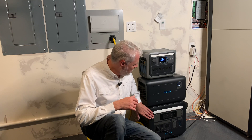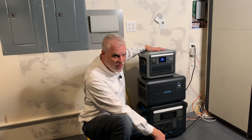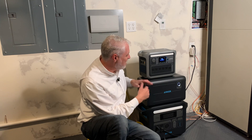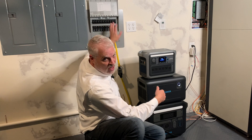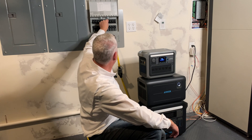We moved to my mechanical room. Beside me you can see my trusty Anker 767 sitting here, and on top of that is our Anker expansion battery — now better known as the Solix F2000. On top of those we've placed our little Anker C1000, and you can see the size difference. It's amazing how tiny, light, compact, and portable it is. I use my Anker as my primary backup system for my home. If we lose power I can switch over to it for my critical circuits through this Pro Trans transfer switch. I have 10 switches that cover 10 circuits in my home and I can switch between grid power and generator power on the fly.